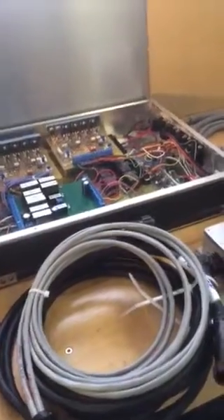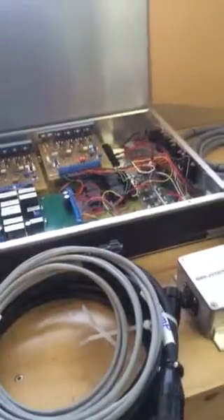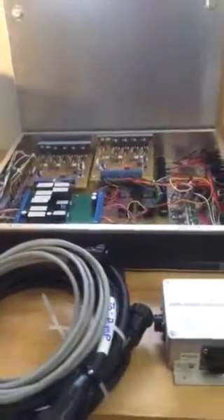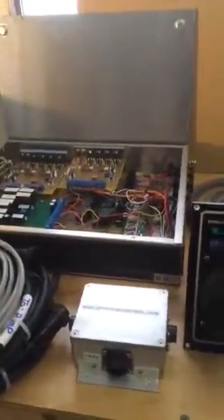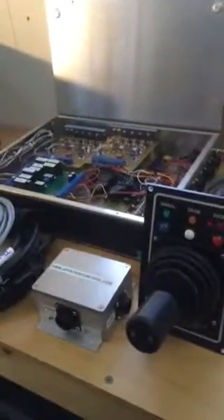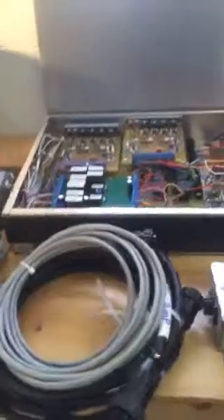Normally on most vessels, if it's not a 274, we connect directly with a hydraulic valve pack. If need be, we would build our own hydraulic valve pack, but most often we interface with the valve pack or valves that are provided with the jet. If they are not provided, then we can provide our own. So here's the complete system layout of one of our systems, a JCS 4200.